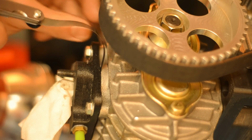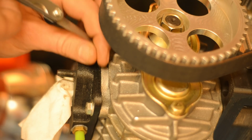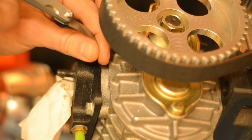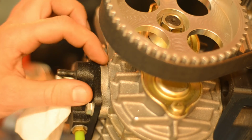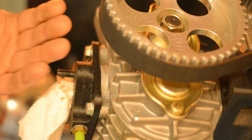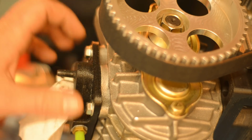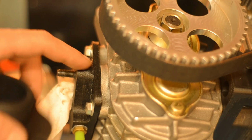Here's where those 3D printed parts failed. You can see here, and this is clamped down as tight as possible, and there's still a gap here, because when you clamp it down here, it bows in the middle. Might be a good idea to have them printed with a spherical face, so that it clamps more in the middle than towards the sides. But now I'm just machining replacement parts out of aluminium.